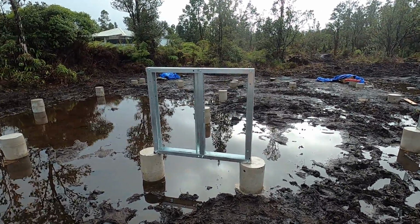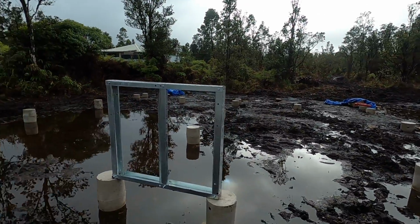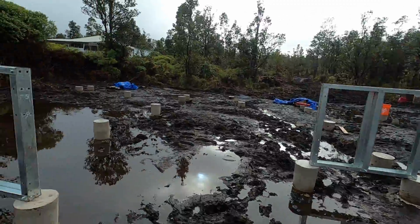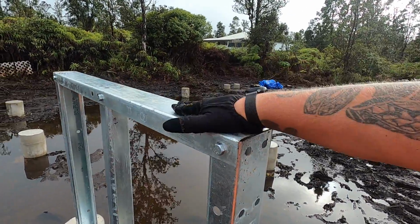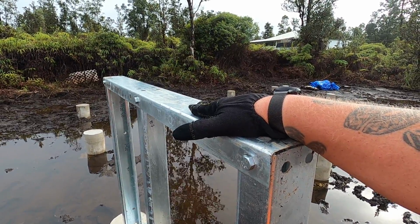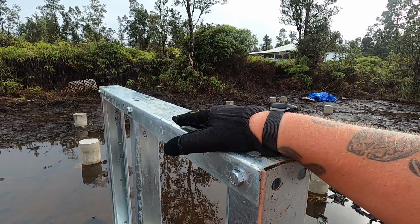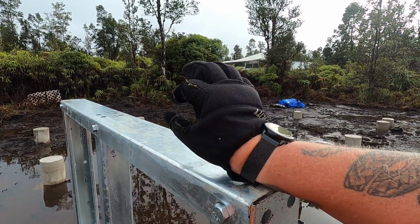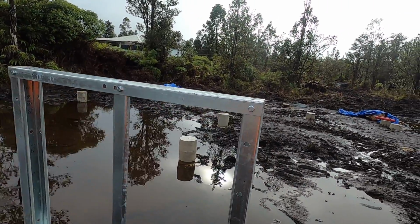So here's our first 2 walls. These are the small partial walls that I have for just extra support for the living room. This one's the kitchen, and that one's the living room. This is actually where our metal pan sits on top of. And this is roughly the height of our living room floor. The actual floor itself will be 2 inches above this because we got an inch and a half deck pan and a half inch plywood, and that sits directly on top of that.